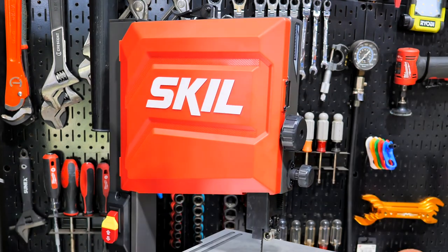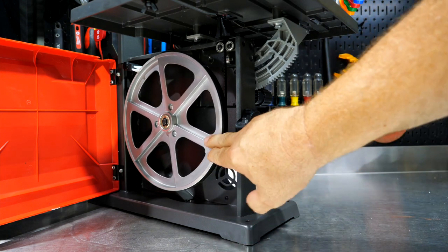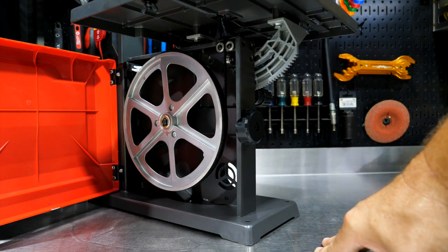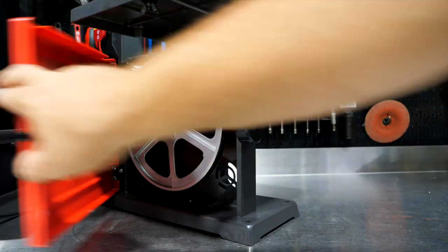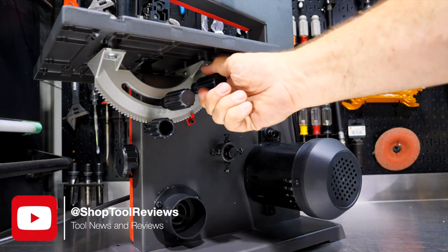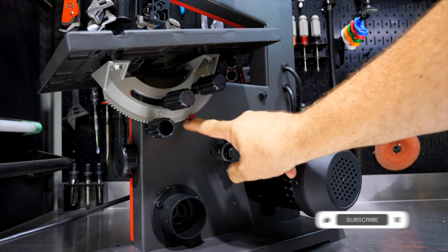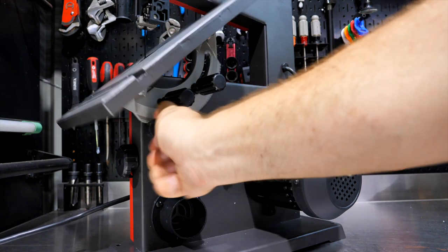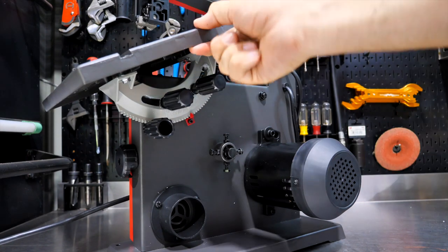On the lower half, turn the knob a quarter turn to access the lower pulley. It's not adjustable there — all adjustability is on the top side. A pulley and belt drive the wheel, which drives the blade. Under the table you can loosen two thumb screws to adjust the bevel, with an indicator showing degrees — 20, 25, or whatever angle you need — then clamp back down.